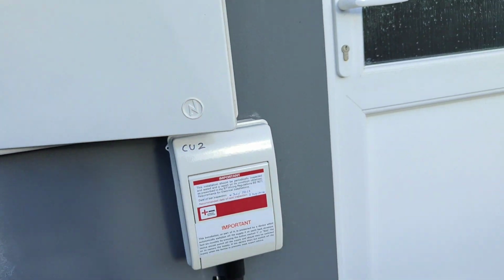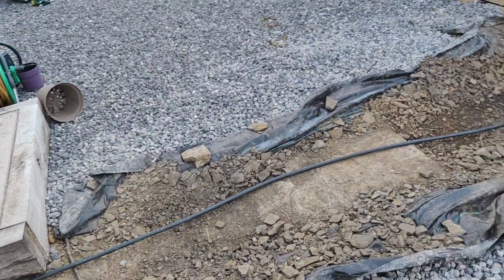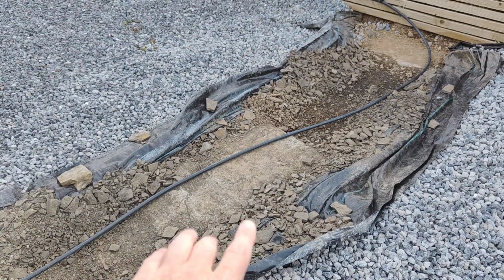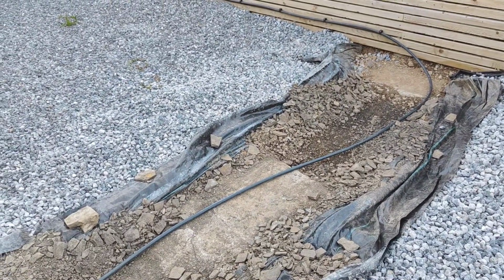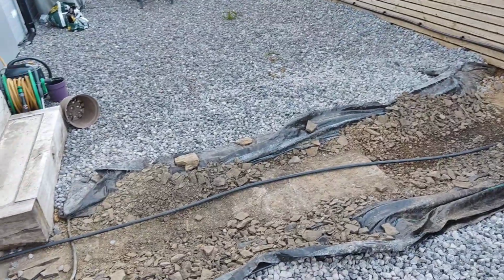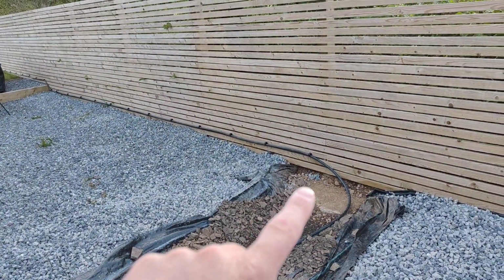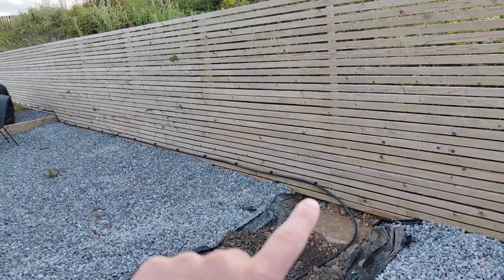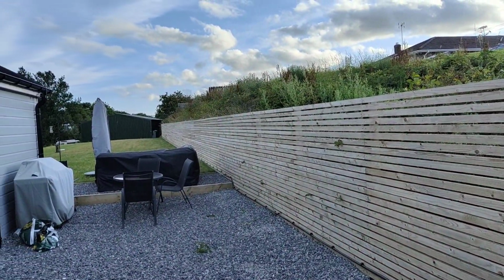That is that. Then armoured cable, which he was quite happy to lay on this floor, but he said to make it safe and no sharp edges, basically to lay concrete over it, which is fine because I've got to concrete the barn where the 2 posts go, so I'll just do a little bit. So it's basically satin concrete, and then we were going to put it behind the fence originally, but that is just too much work. So it's clipped onto the fence all the way down to the barn.